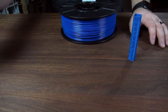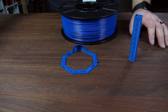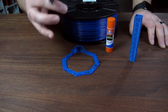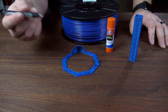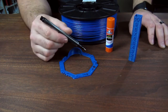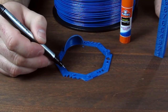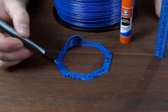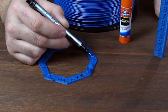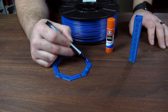Knowing that, I printed this torture test model. I'm printing at 80°C on the bed and using the same Elmer's glue — no curling around the edges with the glue stick, which was nice. Still learning Simplify3D, so ignore some of these rookie errors. Because I don't really have a lot of ambient control, the bridging section just fell off — the plastic was just far too liquid and blobby. So definitely pay attention to that; if you can control ambient temperature, please do. These little details were pretty rough, but I think that's largely due to my lack of knowledge of Simplify3D.